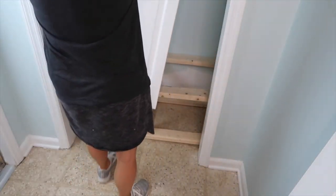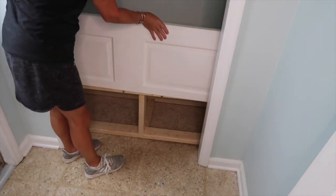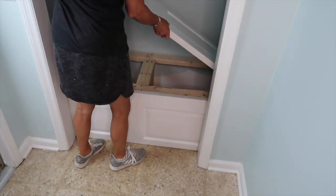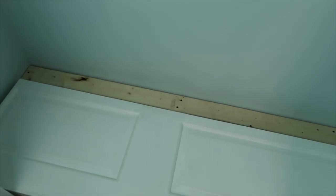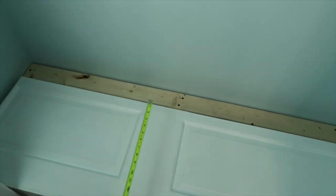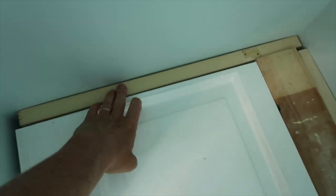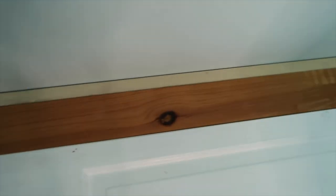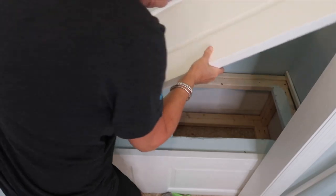With the bifold doors cut to size, I used one for the front of the bench, sliding it into place. I had to use a rubber mallet because it was a little tight. I laid the other door on top, making sure it was nice and square. The doors were not as wide as the closet, so I measured the distance between the wall and the door and cut a one-by-four to size. I also cut thin pieces for each edge of the door of the bench — this was to ensure that when you lifted the bench lid up, you wouldn't scrape the sides of the wall.